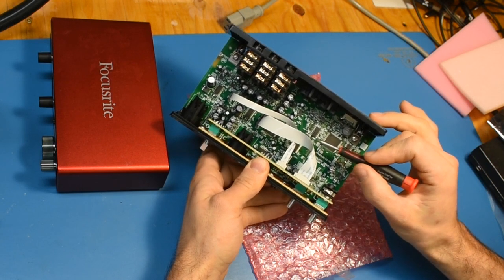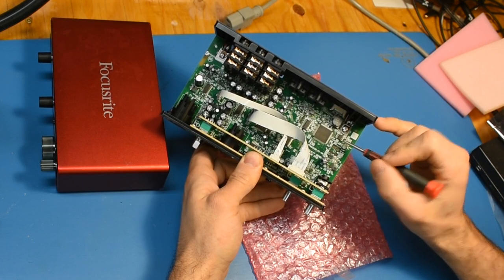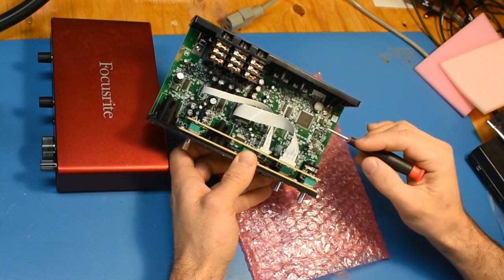The 3 volt regulator is right here, and this one almost always dies. When it dies it short-circuits the 5 volt from USB to the 3 volt rail. That 3 volt rail powers part of the CPU — in particular the USB peripheral. The clock generator I think is also fed from 3 volts, but it survives or it's rated up to 5 volts — I forget. The EEPROM doesn't suffer too much from that. There are one or two other things on the 3 volt rail, but that's the main thing that goes.